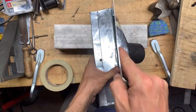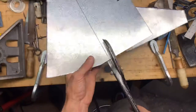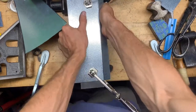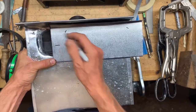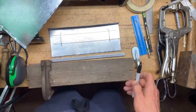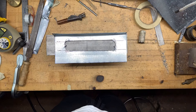Checking if it's flush. Now we've got to get a piece in there to hold the thing in — another scrap of this metal I had from another project. It's another way to bend your metal, just over a straight edge. I want the hole to be big enough so that it does not overlap, but not so big that it's hard to form. I had to do it twice because the first one was too big — second time's the charm.